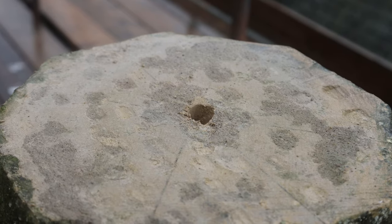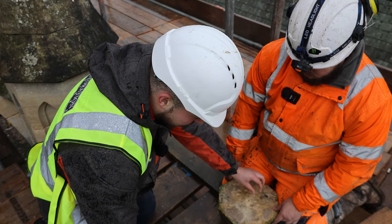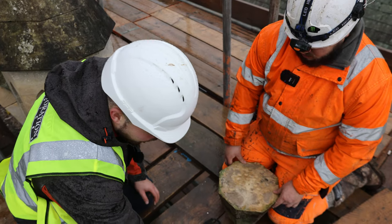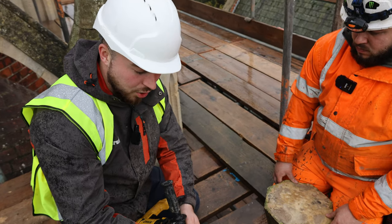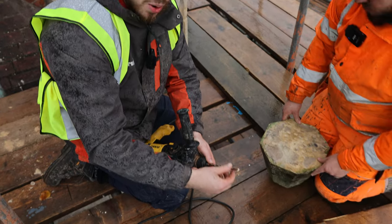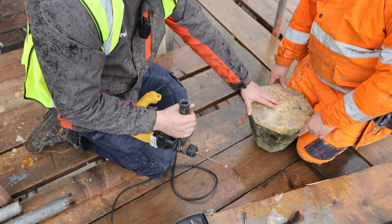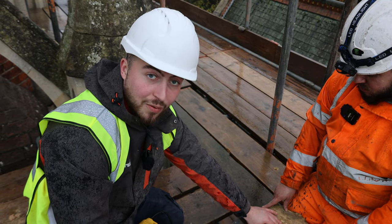So another thing we're going to be doing initially with the bigger drill pieces, we'll measure, as this is an example, we'll have a longer one and we'll mark up on the tape measure how far the depth is, and we'll either tape it or mark it on the drill bit, ready for when we're drilling in here, so it can come right to the right depth and we'll know exactly how far to come.